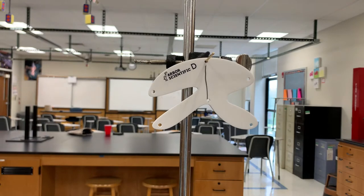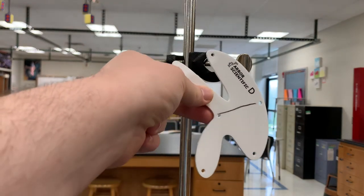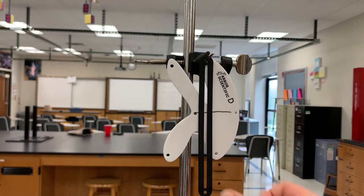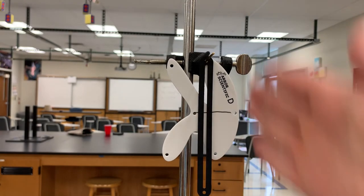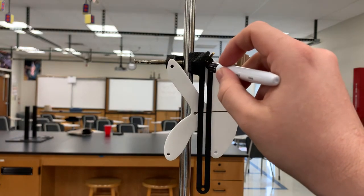And we pull it back and say, all right, there's our line — somewhere along there is the center of gravity. How do we find this individual point? Well, we move to a different pin. We place the pendulum, and the center of gravity is always going to be below where it hangs stably. So again, we can mark the line on object D here.